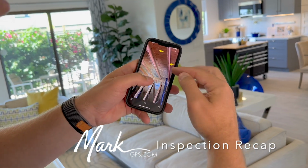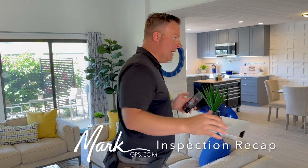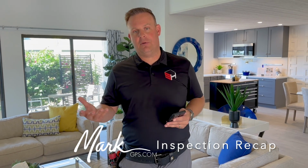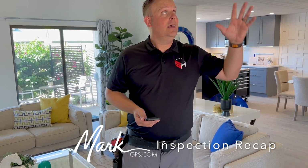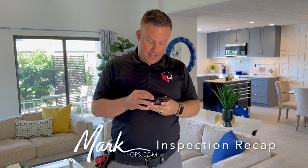There are some old water stains on the bottom side of the sheathing in the attic. You can see where there was a roof leak at one point. It's completely dry right now. With the amount of rain that we've had this winter, probably the most ever, it's dry. Now, we haven't had rain in probably 3 weeks or so, but normally you would still see some type of moisture present if it was an active leak. Active leak, okay. I don't see any signs of repair or issues within the drywall either.